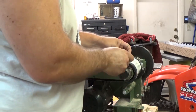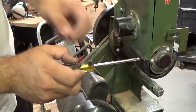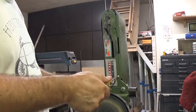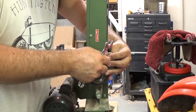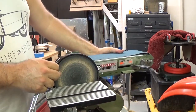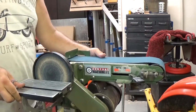And then all we do is reassemble it. Flip it around. This is where you're going to set the height for your guard as well, so you want to pay attention to where this is going to end up. Tighten it down, and then over here on the other side — I like having mine at a 90 degree angle, so I'm going to put mine back there. Tighten up this angle bolt with the nut that's on there, so now it's nice and tight.